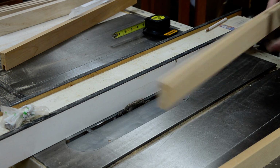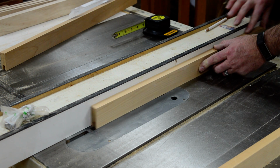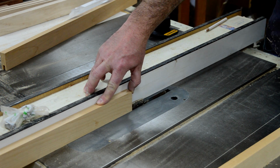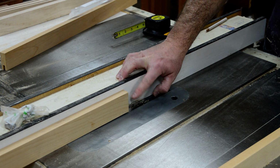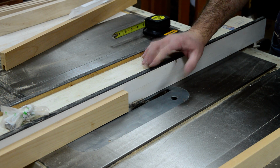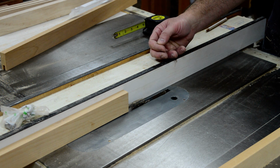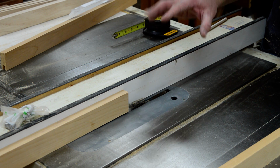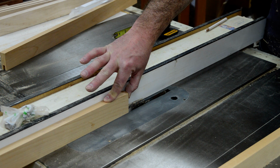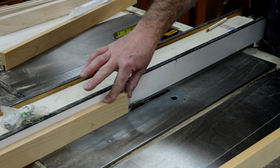One thing that I wanted to address, which I probably should have prior to cutting these things, is there was a small piece of safety to think about here, which you probably all were noticing, and I don't think that's wrong if your spidey senses are going off thinking about how close you are to the spinning blade and the end of this board, and that's healthy. I've been doing this long enough to have a presence of mind about where that blade is. What I was doing, which you probably couldn't see, is I didn't have all of the pressure on this board with my fingers and my thumb touching here and here. If I did that, any slipping would have been problematic.